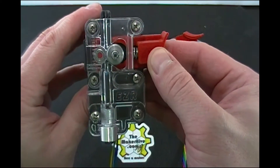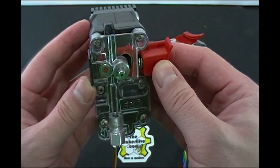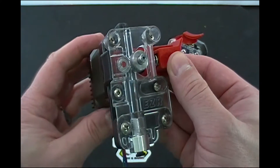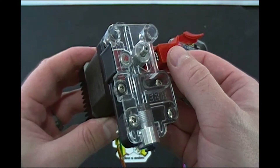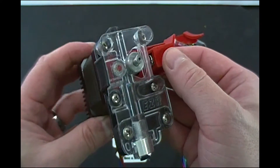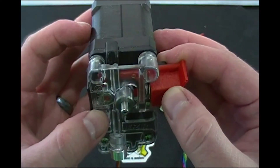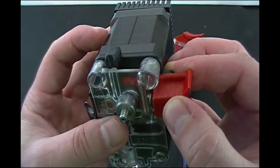This is common with things like nylon too. I know I've had some problems with bridge material being just a little bit too flexible. So if you ever venture into those TPEs, semi-flexes, that kind of material, this is definitely the extruder for you. Another improvement: it's much easier to load the filament on top. That was always kind of a guessing game before and easy to get wrong — much simpler now.